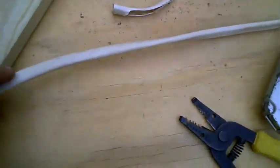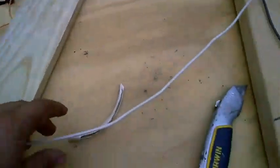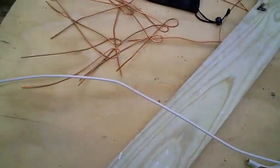How do I make an antenna? You want to start with some 12 gauge house wire if you have scrap, which I have plenty of. What you simply do is you cut with a razor blade right down the middle, and you pull out your sections. This is white wire, and then this is the black wire, and then you've got the copper ground.